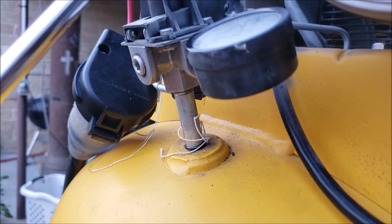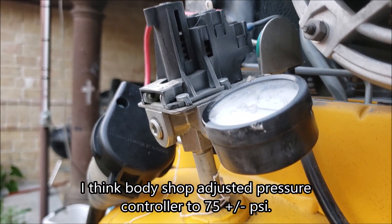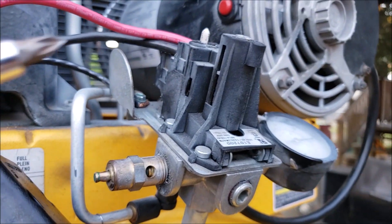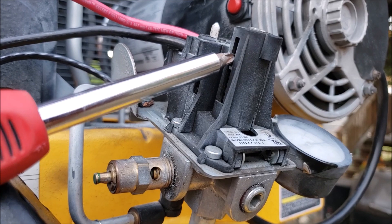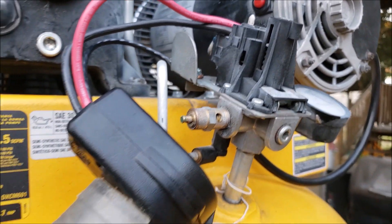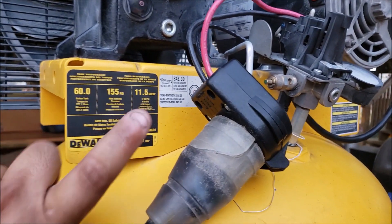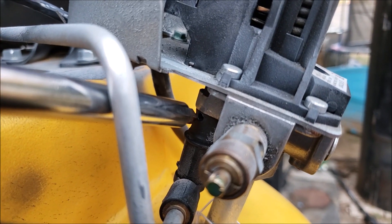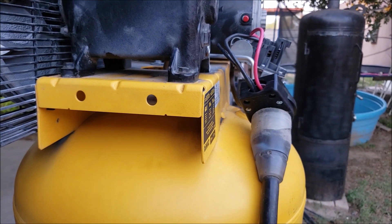I finally came back and paid attention to the pressure controller and decided to give it about two turns. It was still dumping air at around 75-80 PSI. Took the cover off the new compressor I had bought and noticed this little tab was way down — dropped it down about a quarter inch, and that actually turned off the compressor right at 149. It's a 155 PSI compressor so I can do a bit of fine tuning. Now here where the screwdriver is — the tip of the screwdriver — there's the orifice on that plastic piece where the air comes out, and it was dumping for about a minute or so.